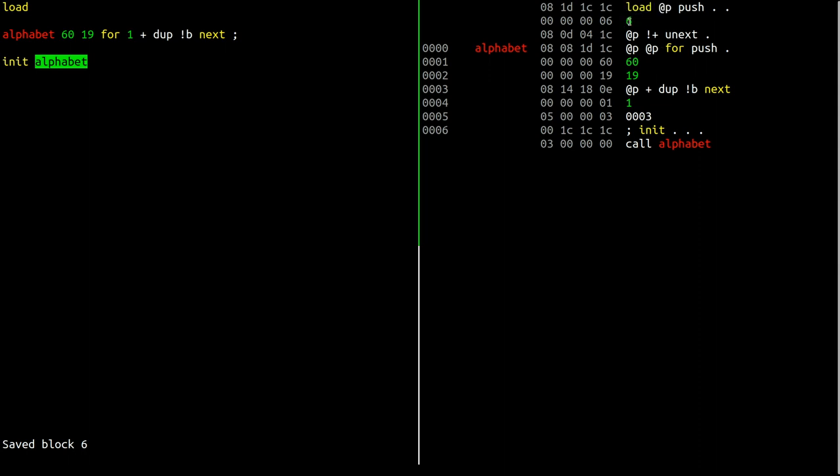So it creates this fetch P that fetches this 6, which was computed to include all of the instruction words to follow. There's 7 of them, minus 1, so 6 for the induction loop. And then this instruction word, which is part of the stream, is just a little micro next loop. So it does a fetch P and a store increment, which stores through A, which begins life pointing at memory. So this little tiny loop will just fetch through the P register off of block 0, storing into memory, do that 6 times, 7 times, and the program will be loaded.